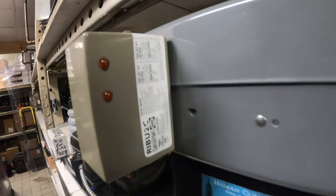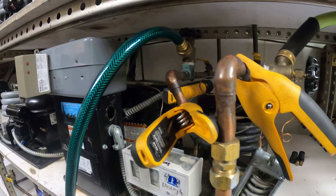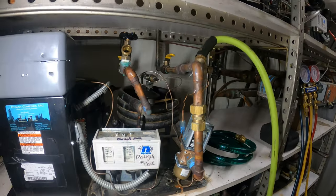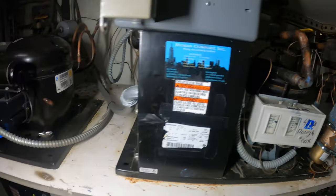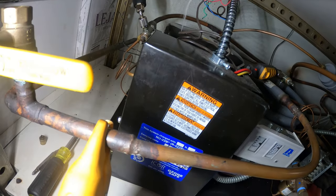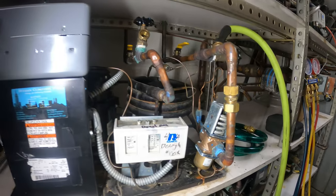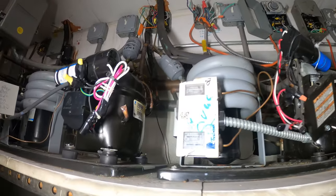The LED light is no longer lit — the box has satisfied the thermostat. This unit is good to go; the box reached temperature. It was a tricky one and unfortunately these units are in terrible condition. We definitely need a strainer on this system. We're going to check out the second unit next — it likely has the same issue and we'll flush those lines too. If you found this video interesting or helpful, please drop a like, comment, and subscribe. New videos come out every week — catch you all next time.